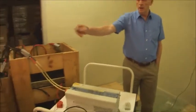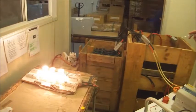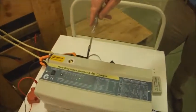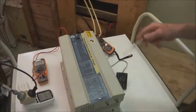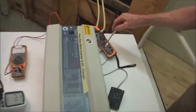At the moment, the inverter is running off the batteries and supplying power to the lights. Now I'm going to turn the AC power on. The inverter will wait for a little while — it checks what's going on and it will switch over into charger mode. At the same time it's able to charge the batteries, and you'll see the charging current has already come up to 27 amps.